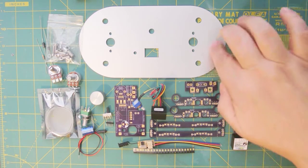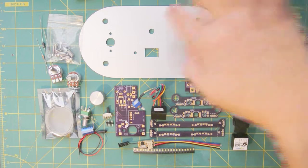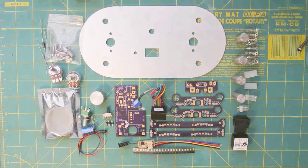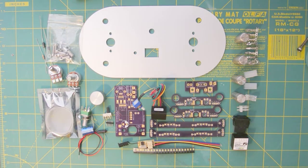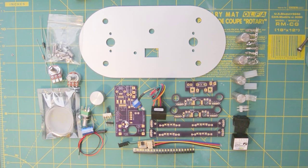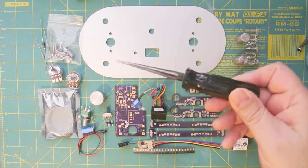On the aluminum plate, I've designed it so that it will come with smaller holes so that you can flush mount it. If you want to shadow box mount it, you'll need to enlarge the holes to 19/64ths of an inch in diameter, which you can either drill out or ream out with the tool shown here.